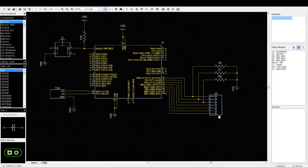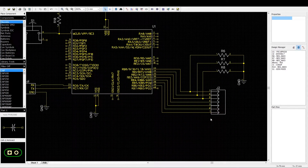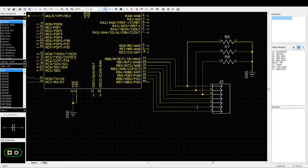Hello, and in this PIC programming tutorial I'm going to be covering how to interface with a keypad. The hardware setup is going to be a 3x4 keypad with four of the pins connected as outputs to the B port. The other three pins of the keypad are going to be connected to the B port as inputs, and the input pins are going to be pulled down low with a 10k resistor.